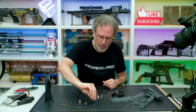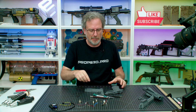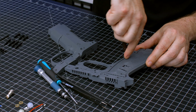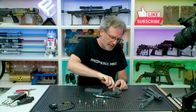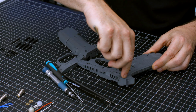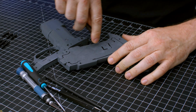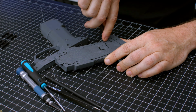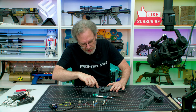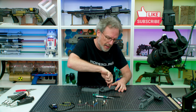by removing the support material on our 3D prints. This is all we need. Every now and then we'll need some pliers, but this comes off pretty easy. The trick I find is to go around the edge and try to lift it up and pry it off the bottom. You can actually find pre-supported files on Blamcon.com as well that are ready to go for many common printers.